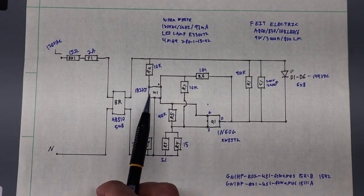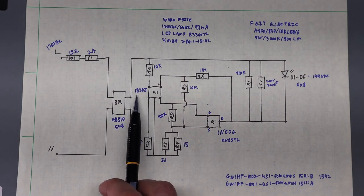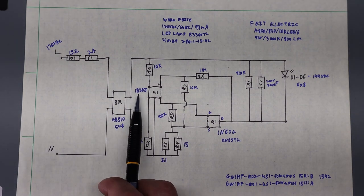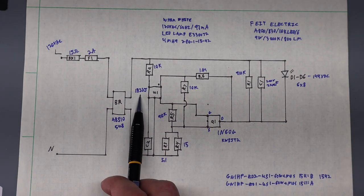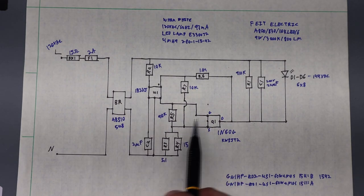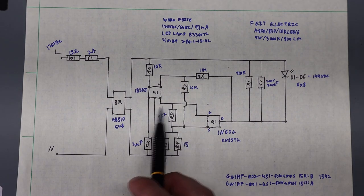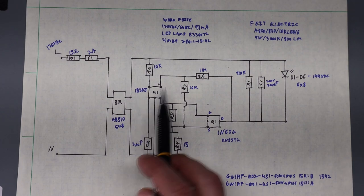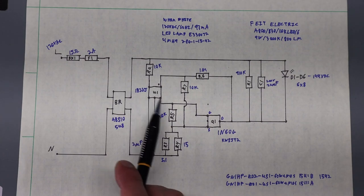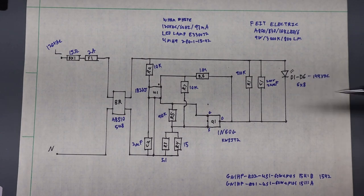As for the circuit, I could not find a part number on it. The number on it was just a manufacturing number, not an actual part number. But from what I can gather, it's controlling the gate based on the voltage dividing happening everywhere. You know, a 1 megohm resistor over there too. So it's sensing what voltage everything's at, turning this on and off so that this gets the exact voltages and currents it needs to operate.